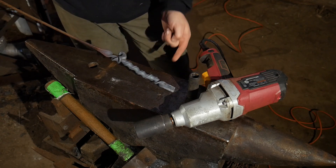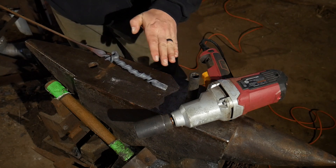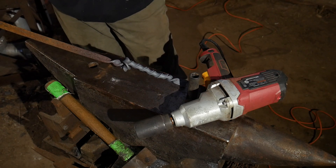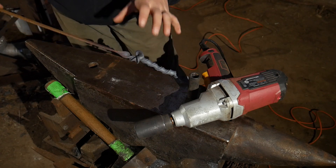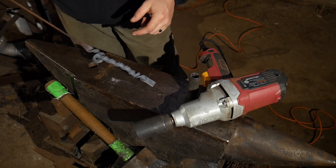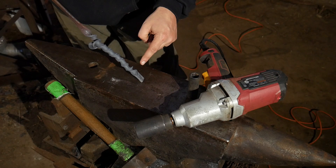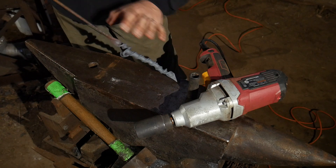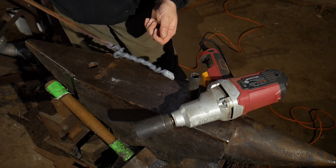Now, the torque of this torquing around caused that — any sort of bend you may have in this is going to create a bit of a pretzeling effect or a pretzel twisting effect. That can be a very neat element in itself if you design it into your ironwork. But say you're trying to get this type of twist right here in this bar stock of the flat — just from the flat twist — you'll want to make sure that this piece comes out as nice and square and level as you can.